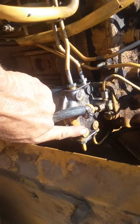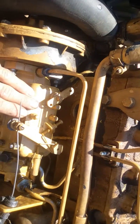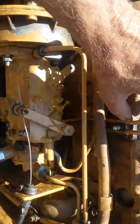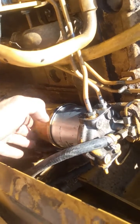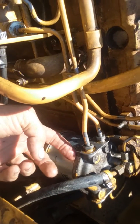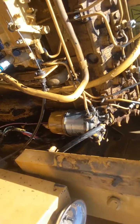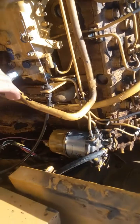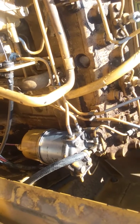When we were pumping it up, it was just pressurizing this, coming down here, pressurizing the front, and filling the reservoirs. Once the reservoirs were full you could prime the injectors, but you'd dry right out. There is a washer up here that, if it comes off the seat, can get squeezed into the center of the filter and clog the holes on the very outside edge of it. That keeps your flow from going down into and through the filter element — that's what happened.